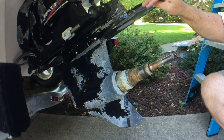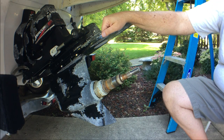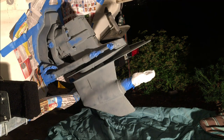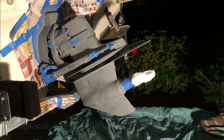You can see this outdrive needs some work. I've already purchased new sacrificial anodes, so I'm going to do this by hand. The goal is to seal the outdrive to stop it from corroding and also improve the aesthetics. It's really late at night — I'm just showing an in-between step on the outdrive. I've got it sanded, then I ran over it with a chemical that cleans the surface, taped off what I don't want painted, and I've got the primer applied.